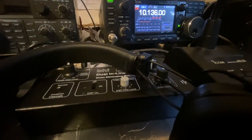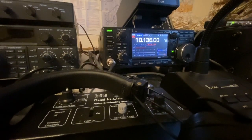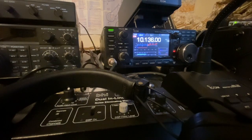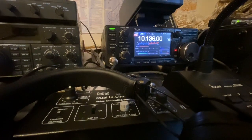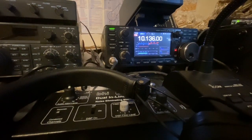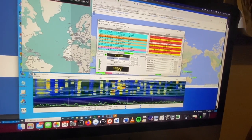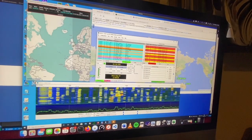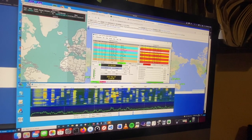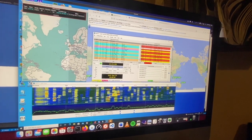Power's going out, no compression, ALC's good - not too bad. Pre-amp is about okay. As you can see, the power is just totally going out the antenna. I'm going to call UT2IP - he's been really patient waiting for me to call back. Let's do the honours, and then I'll change band to 80 metres to see how we get on there.